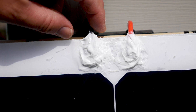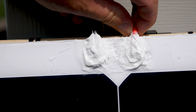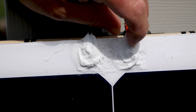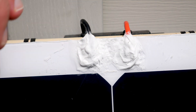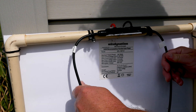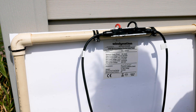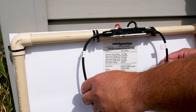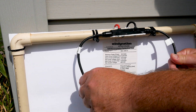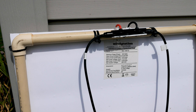It's the following day and the silicone has set up. Everything is nice and snug and tight and has been strengthened. I'm pretty happy with the results. Mounting the connector onto the frame provides a lot more strength and stability for those wires — you can pull on them and they won't move. This was the problem with the original panel: once you put on those wires, they would pull against the connector, which was mounted directly on the panel. Moving the connector over to the frame is a much better setup.